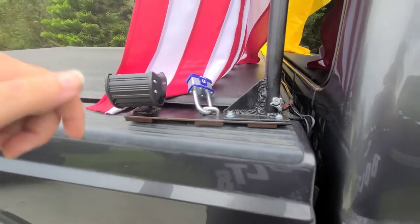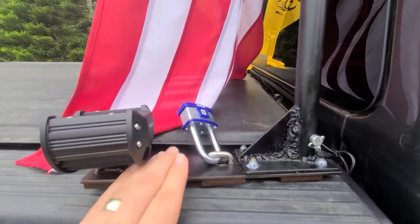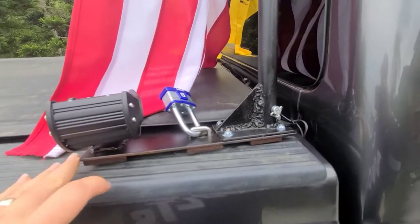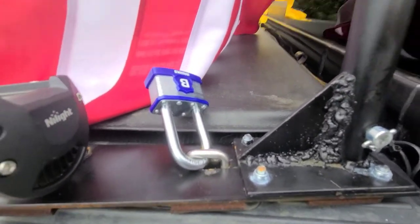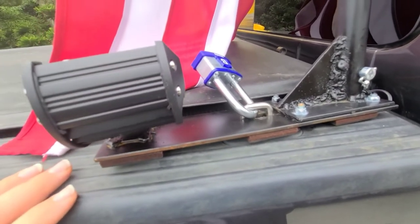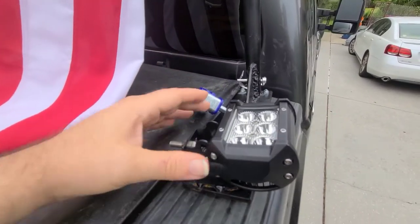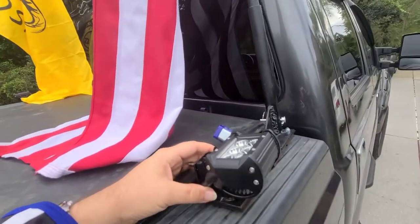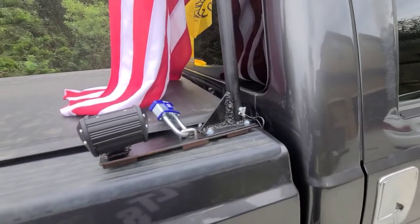I'll have links for all the parts and supplies in the description. I got some flat stock from Lowe's — 3/16-inch steel — cut into one-foot sections, cut a hole in the center for the latch to pop up through, added quarter-inch furniture pads on the bottom, and welded a small metal tab to hold the lights. The lights were about $15 for the pair — water resistant, actually pretty waterproof. I've had one submerged under muddy water with no problems.